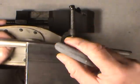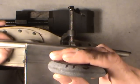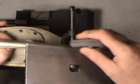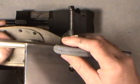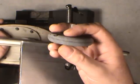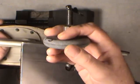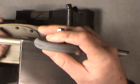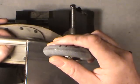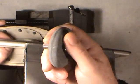And what you see on this grinding wheel, you can actually see the felt pen that's on there. That's the felt pen that's rubbed off of the skate as I was doing it. Or I could have been using that as well for checking the true after I dress the wheel. Sometimes another thing I'll do is steady my hand up with a felt pen and just touch down to see if there's any spots where it isn't making contact. Then I know I have to dress it down a bit further and it's not running true. So there's two reasons why you'll see that on there.